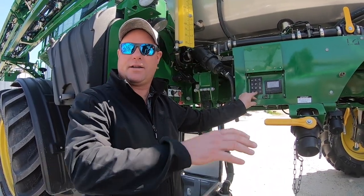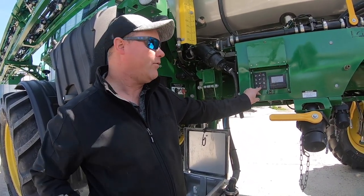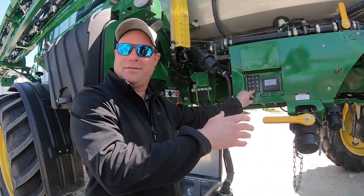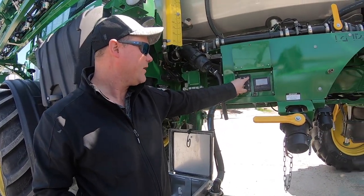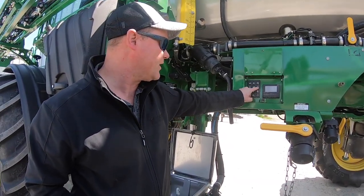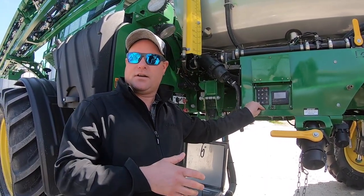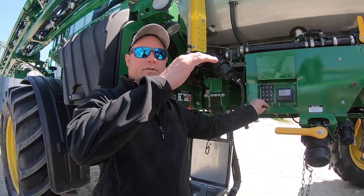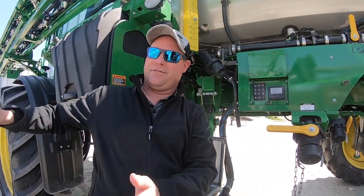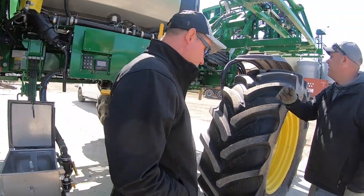There's a rinse icon covered later. Two other icons: if you're using the sprayer pump to load — when the nurse pump isn't being used — you need a three-inch line with as little interference as possible to avoid cavitating the pump. Hit the button, ramp up the sprayer pump, and it'll suck on — as long as it's got prime. There's also a target fill button: set a target like 600 gallons, hit enter, and it sucks on that amount and shuts off automatically.